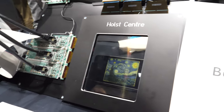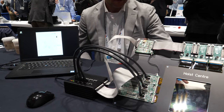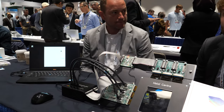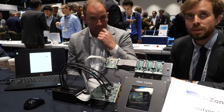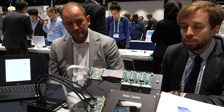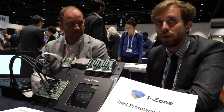You can scan your whole hand with the device. In principle it can also work as a touch panel replacement because it can detect where you are touching and work with gestures. The sensing range depends on light conditions and the application. The key is a very sensitive photodiode that can be patterned into very small form factors and small footprints. You can scale down the TFTs and the lines, and it's all about integration — with light coming from all directions, you can place it anywhere in the screen.